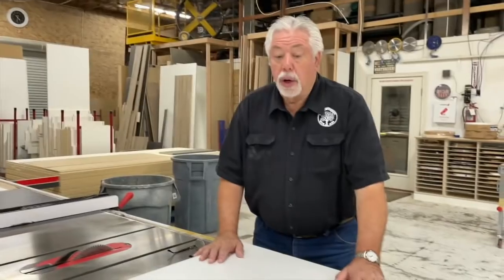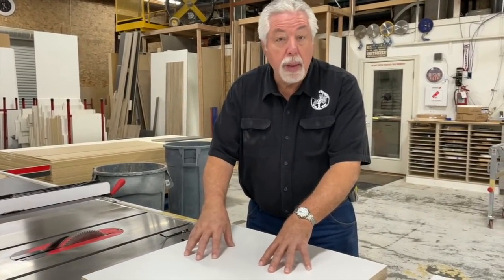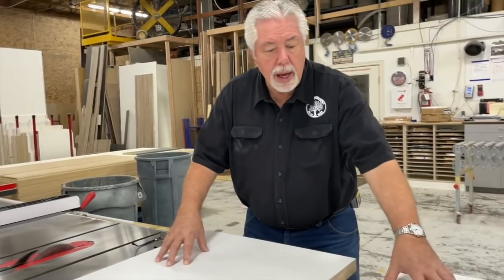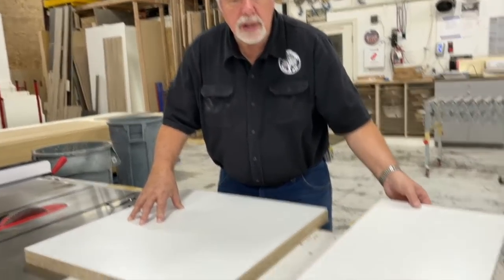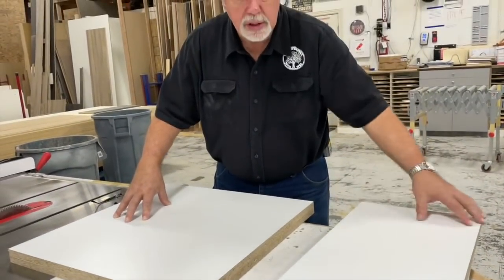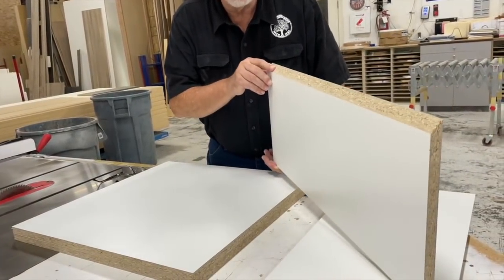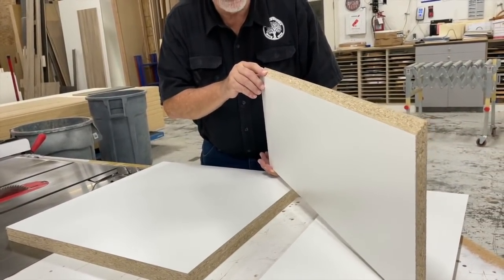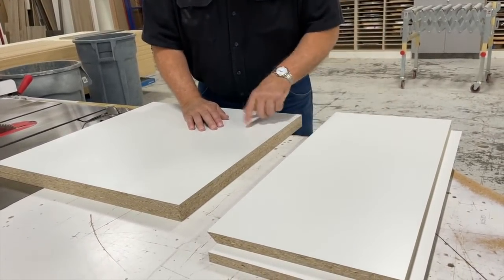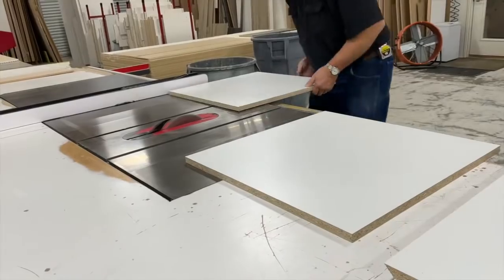We're here at the table saw, and according to our layout drawing, these are the floors, the top and bottom shelf. They have to be 23 by 23. And the height of our cabinet is 28 1/4, so I've already cut the sides 28 1/4, but they need to be 11 3/8 total distance. Now, the total distance is from the long point of our bevel. I've already put the bevel on, the 45 degree angle, and all we'll do is cut those 11 3/8 inches. So let's just go ahead, turn on the table saw, get our pieces cut, and then head back to our bench.